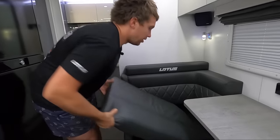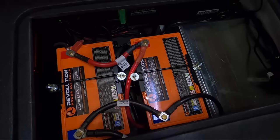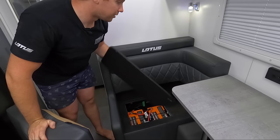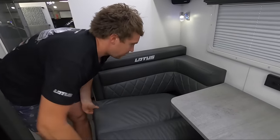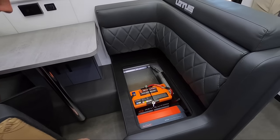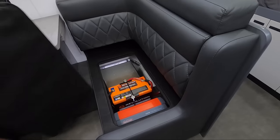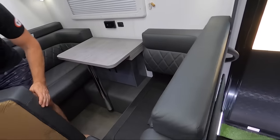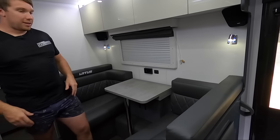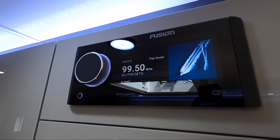We sold our generator — we're probably going to get another one just in case. Make sure when you do this, you want to tell them you want the air con connected into your power system. You'll need at least 300 amps — our next van, we'll probably go 400 just so we've got a little bit more and won't need a generator at all. Under here we've got two of the batteries — they've done an absolutely amazing job with nice big thick cables, really nice work. You've got your big BMS at the back there, all your solar chargers under there. Over the other side, we've got the third battery with the inverter right there as well. Got a nice Fusion screen — amazing quality, you can control it from your phone.